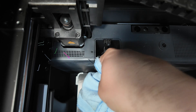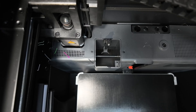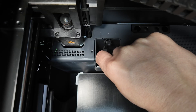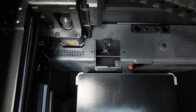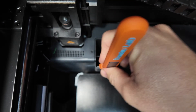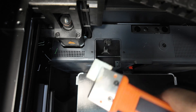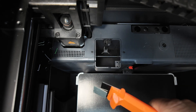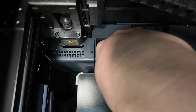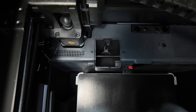That's how I was stopping my poop chute clogging up. The problem with that is, depending on how many prints I did, I'd have to redo it. And I really don't like having excess grease inside my 3D printer. I'll try and remove this with my fingernail — nope, it's not coming off. Any tool similar to your bed scraper will do the job. There we go. Some isopropyl on the rag — I tend not to spray the isopropyl in the printer; I like to spray it on the rag and then go in there and wipe things up.